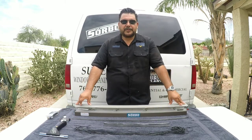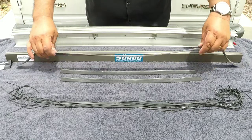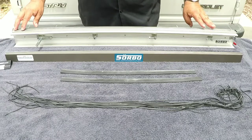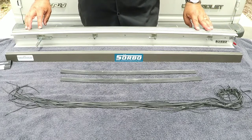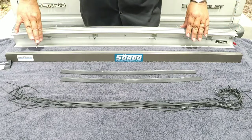Okay, I'm going to be doing the demo right now. Open up the docket. I'm going to be demonstrating it with a 36 inch squeegee rubber. Put it here in the slot. Now it's very important that you slide the squeegee rubber flush with the stop right here. If there's just a slight gap it won't be a good cut, so make sure it's flush with the stop. Okay, close the docket.